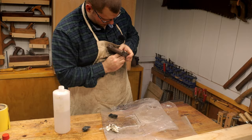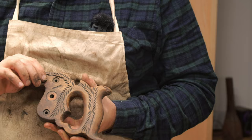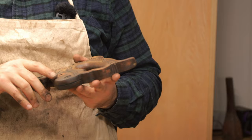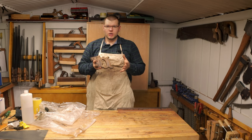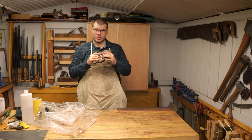There's still quite a bit of dirt especially in the relief carving, but I want to keep that on this saw — as a bit of wood patina, to show some of the history of the tool and show that it's not new. It's an old tool that's got a lot of history behind it. So in this case I'm just going to finish this handle with a little bit of linseed oil, and once that's dried I'll follow up with a bit of paste wax. I've got raw linseed oil here so I'm just going to dunk both ends in and let the excess run off.